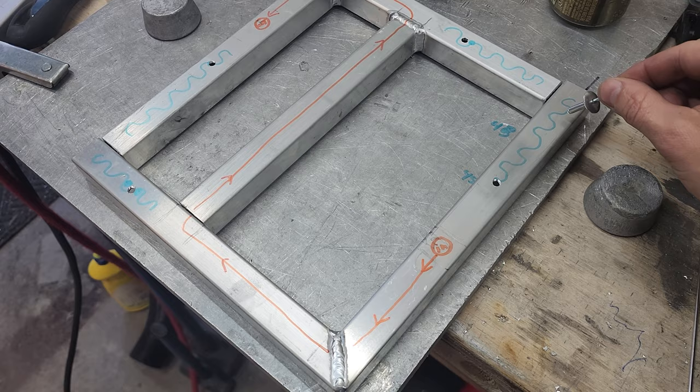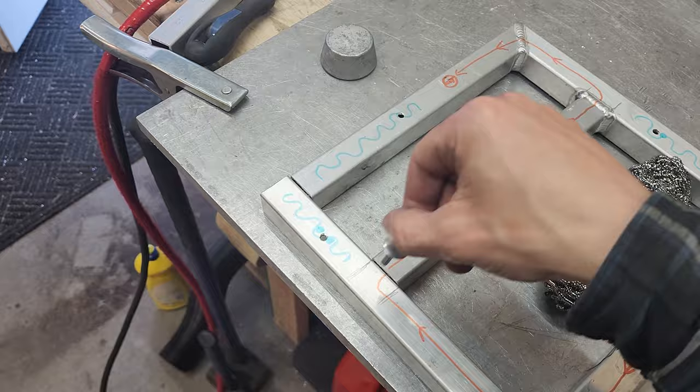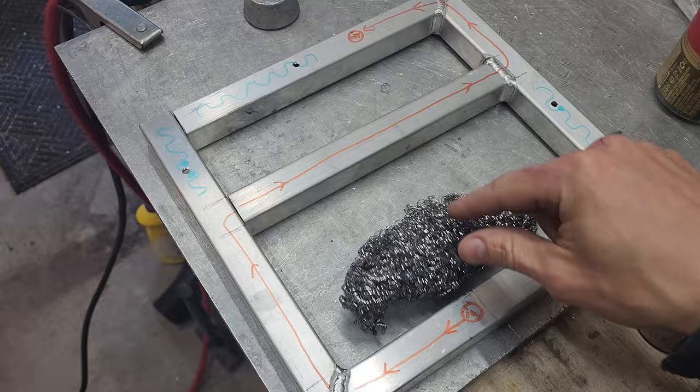That's where I'm going to pack some of this stainless steel stuff to absorb sound. And then again here, it's gonna go straight into all this stainless steel stuff to absorb sound and have to turn sideways. More stainless steel stuff and more stainless steel stuff. So that should be a lot of corners to absorb noise. And in order to keep this stuff put, I want to stuff some in here and I don't want it to over time jiggle over here and then block my flow. Because if that was stuffed right inside the whole thing, it'd actually add a lot of resistance to the exhaust.